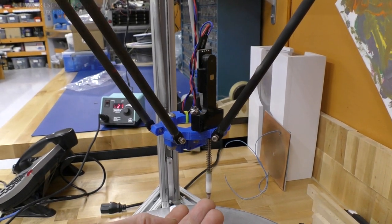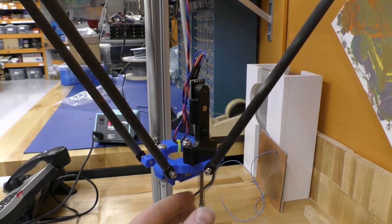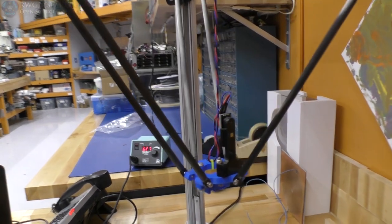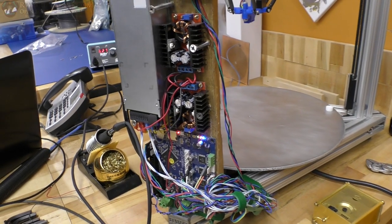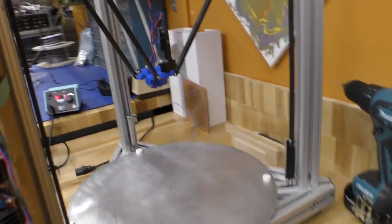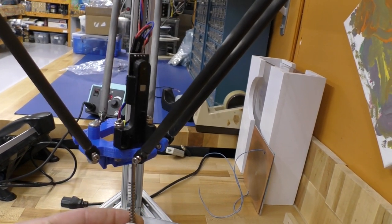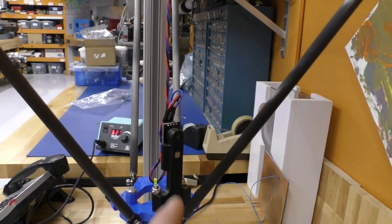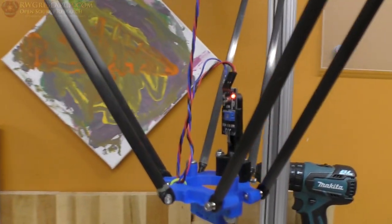So I could make this into that style of sensor, automatic deployment. Right now you have to pull it down. And then when I want it to sit, I just take it off and I put this away because I normally don't use it. But with the Duet and the way it's set up, it probes every time, or it's best to probe it every time, or you can probe it every time and set up mesh leveling. So I need to be able to make this more permanent. But it works really well. Now this was not my original design. Someone else designed it, and then I modified it to accept this style sensor, which I'll put the links in the description. And yeah, that's the current sensor, so let's probe.